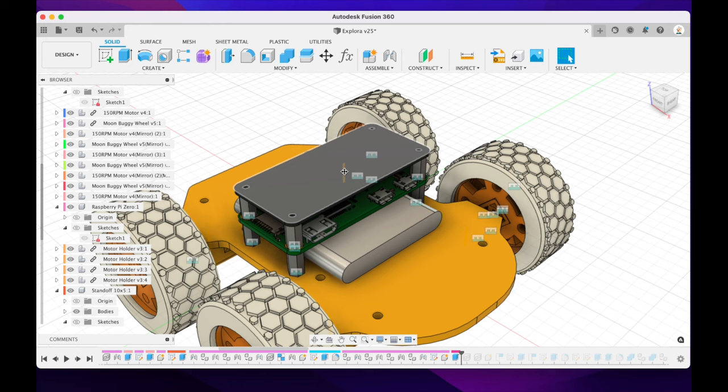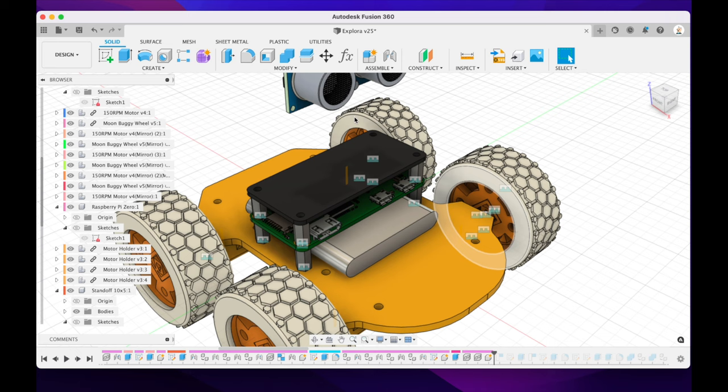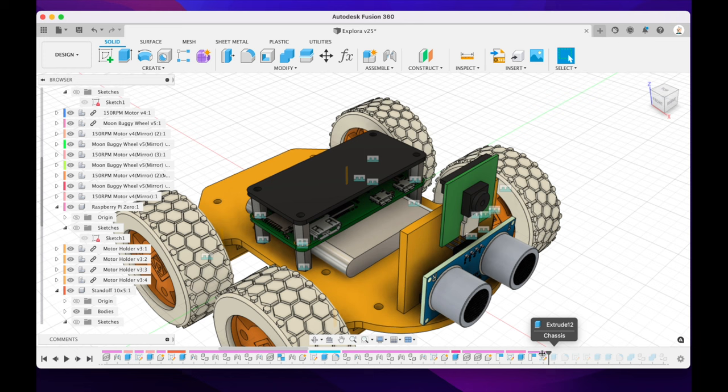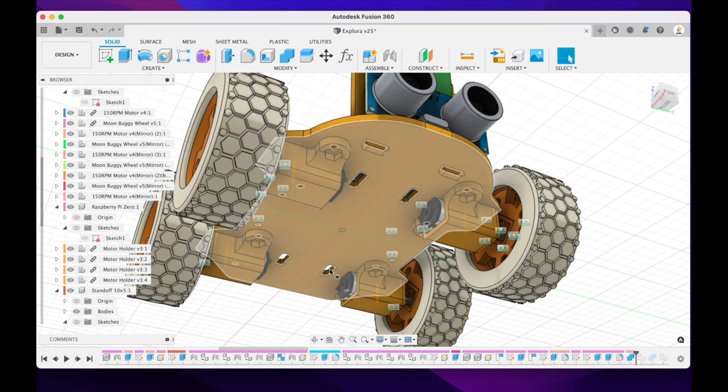Next is the Explorer HAT — I haven't fully modeled it out, but I've put the basic dimensions in place. I then brought in a range finder that I built for a previous project, and also the Raspberry Pi camera module. I'm going to make a similar kind of structure to the Trilobot that holds both the range finder and camera in place. I've pulled through a couple of lugs through the chassis and used the camera holder as a cutting tool into the chassis — keeping the tool — so the lugs push through and make the holes. I've also cut out a couple of extra holes next to the motors for the motor wires to go up through the chassis.